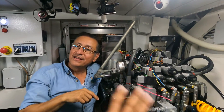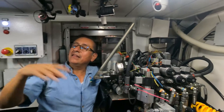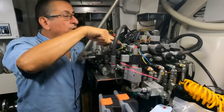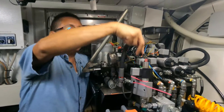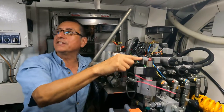So all of them are here? Yes, everything is here — I don't have it in another place. For example, if the captain says the swing platform is going down but not up, you identify which solenoid is for down and which is for up. You remove that one and bring power directly here. If it goes down now, probably that solenoid is damaged.